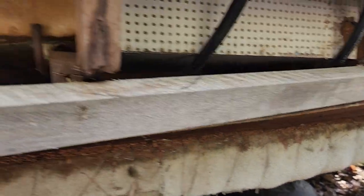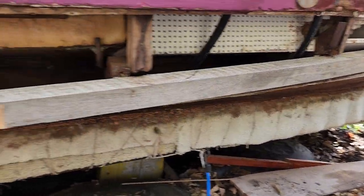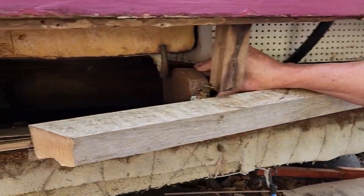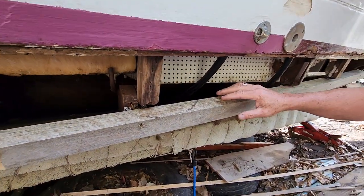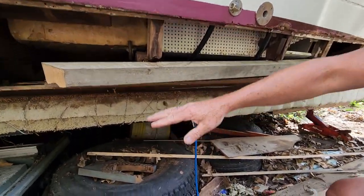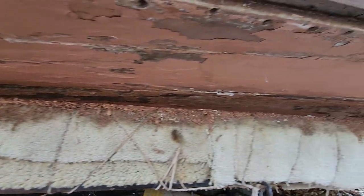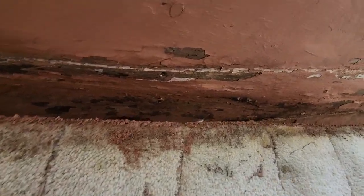So other than the chine right here, which is a sideboard that was severely rotted and we've been bending into form all winter, what else is the issue here, Ed? Well, what you got are the support braces here that go down to the center of the boat, and there's about 4 of them that need reinforcement, and they will push the floor back down because the rail pushed the floor up. So they'll push the floor back down, and then we'll put new wood and reinforce everything. And with the boat raised now, we can get it to sort of form itself back to the original shape.